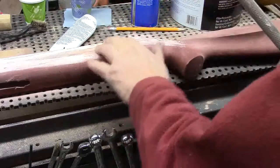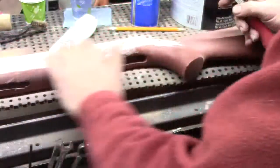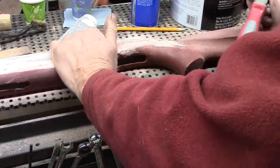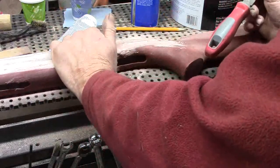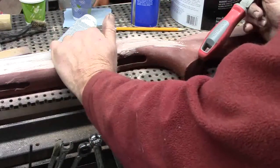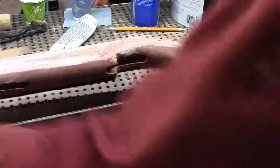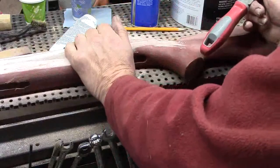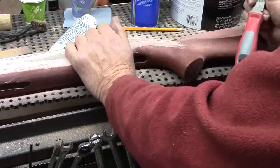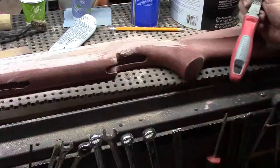It's been about 10 or 15 minutes and it is pretty well set. I removed some more paint on the length of the forearm with 80 grit on a block of wood. I prepared a section of the workbench to my right by putting down a couple widths of wide plastic packing tape. I'm going to smooth this out, smear bondo over the whole thing, take it to the other workbench, squish it down flat onto that packing tape, put a couple steel weights on it to hold it in place, and develop this new extra thickness to the forearm to accommodate this feature.